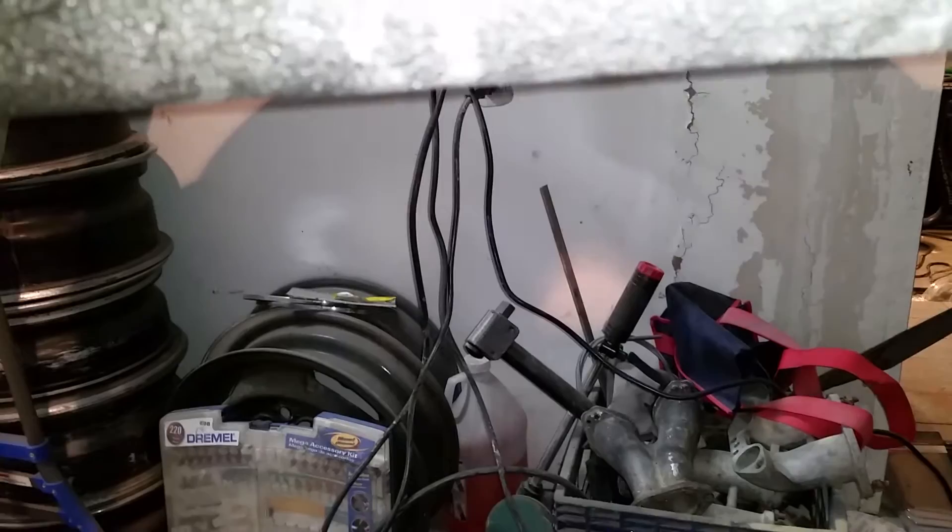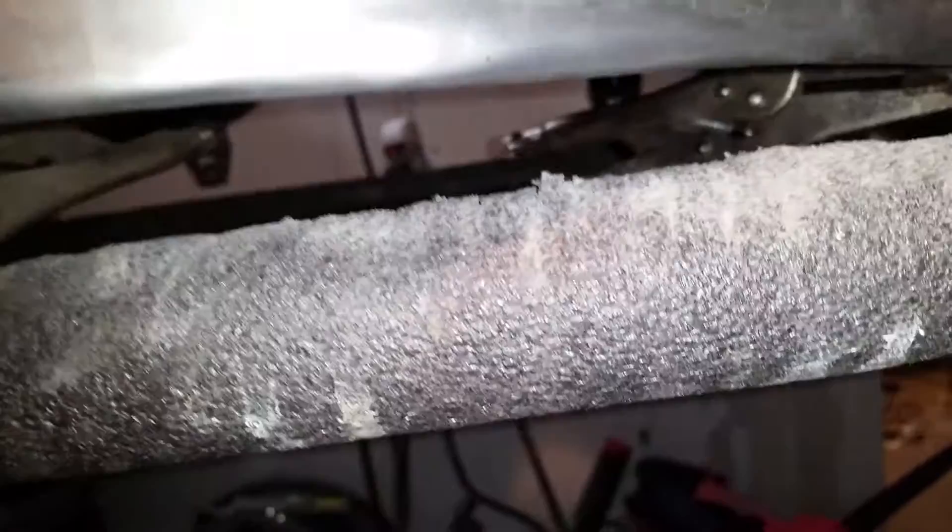We have this mostly bent around. What's going to happen is the metal starts to fold up here because it takes very complex hammering to do something like this. I'm going to sharpen up this edge with some type of chisel just to put a hard crease on this thing here and a hard crease here, because as you can see this crease is very sharp but my break here is not so sharp. So what we do is work on that to get the fold to work.